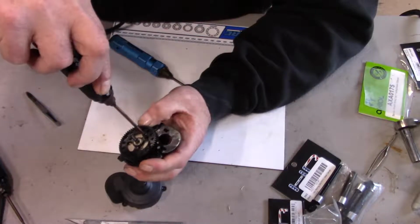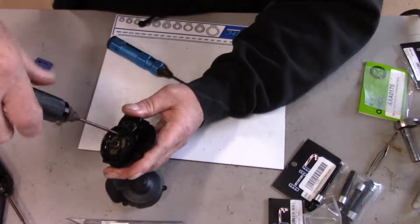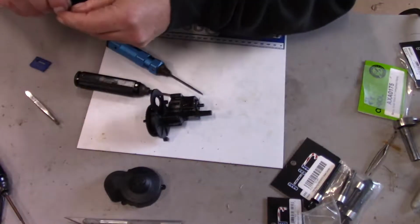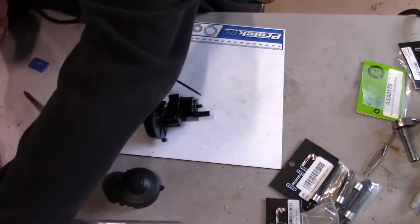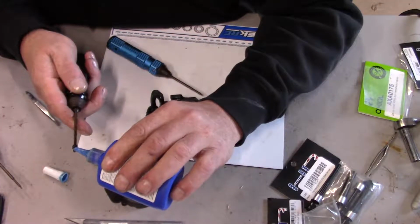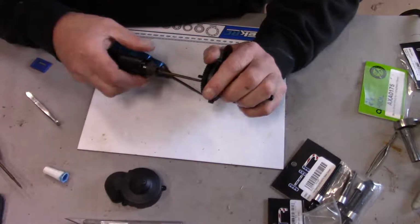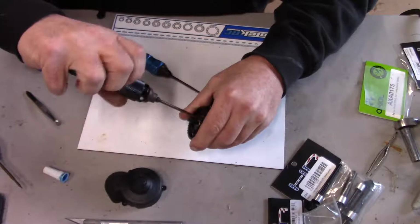Now I don't know if I mentioned, but this is a 56 tooth steel spur gear, 32 pitch. So I got that one started, so all the other holes will line up now. But on the other two, I'm going to put just a dab of Loctite on them, and I'll pull that one out that I just put in and Loctite that. So I just put the one bolt in, or screw, to get things lined up. Now we stick this one in. And I can take this one out now. Go ahead and put Loctite on it.